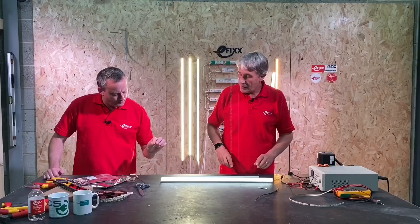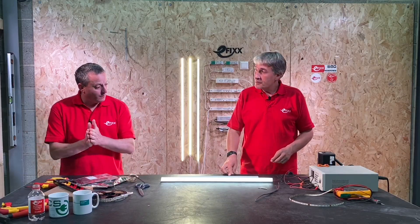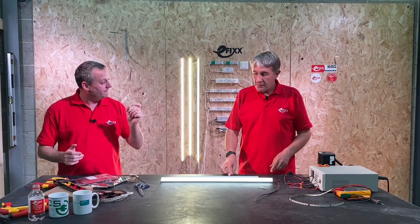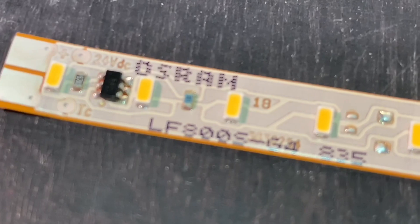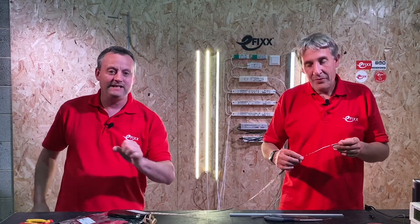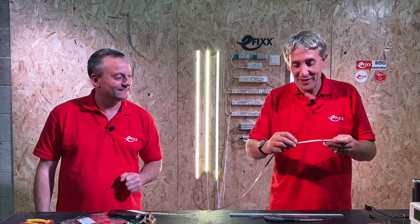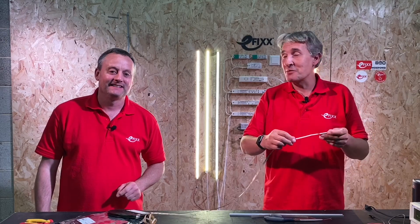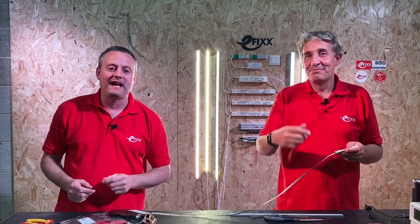We used more LEDs with a short pitch, giving more flexibility in the distance between cuts — 50mm in this case, though it depends on the manufacturer. Top tips: cut only at the marked cut points, not anywhere in between. Sometimes they're marked, sometimes they're not — so read the instructions before you start. Check out the other videos in this LED strip series in the description below, the card above, or the end card.